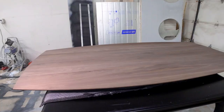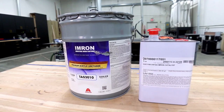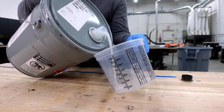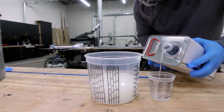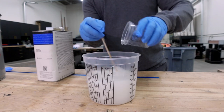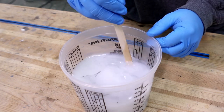By the way, Transtint looks chalky when it's dry, but this will go away with finish. The clear finish I'm using is the Imron acrylic polyurethane line — it has a sealer, top coat, and catalyst. Just make sure to use proper protective equipment. The sealer is used for the initial build coats, with 10% catalyst added to activate the curing process. That whole mixture needs to be reduced about 20-30% with butyl acetate to make it sprayable. I'm also adding a few drops of the same black Transtint dye to further tone the wood a slight bit darker.